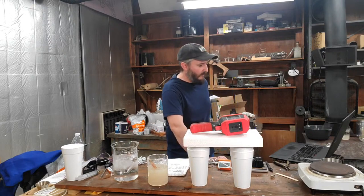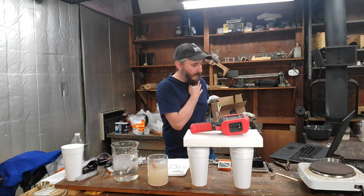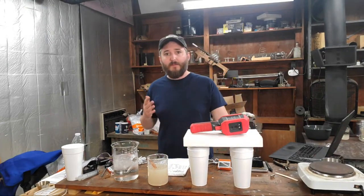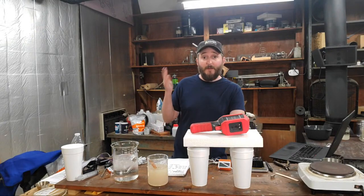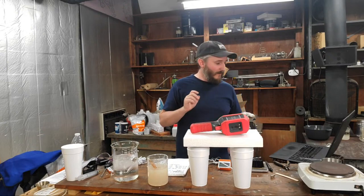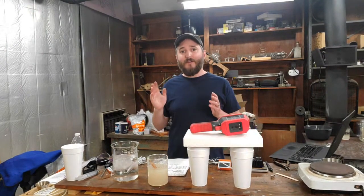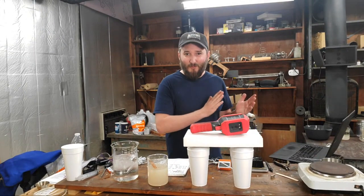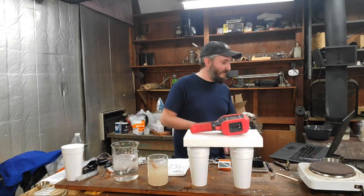That seems unlikely, that the claim would be 15 degrees Celsius below air temperature for a commercial paint. That would be pretty revolutionary. I've not heard any paint that does that. I would imagine if it's like the paint that I've used to paint my barn roof, which is supposed to be a cooling paint, that it's not a paint that actually goes 15 degrees Celsius below ambient air temperature, but rather it is guaranteeing 15 degrees Celsius below your current roof temperature. That's a lot more likely than 15 degrees C below ambient.